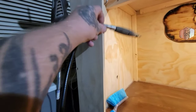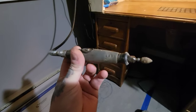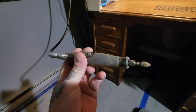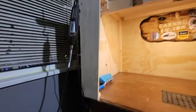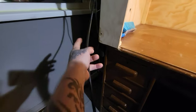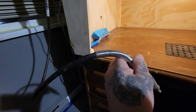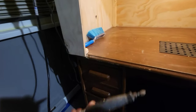I need to put a slot here so I can hang my Dremel when I'm done carving. Because when you've got your Dremel hanging there and you're done carving, all the grease on the inside of the shaft is hot and it will drip down into your handpiece — and that's how your handpiece overheats. So it's good to have your Dremel hanging higher and leave it like this when you're done so the grease sits in there. When I buy a new Dremel flex shaft, I take the inner flex shaft out and remove the grease — it works better for me.